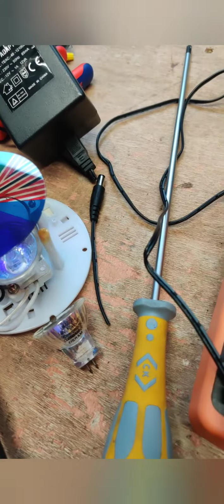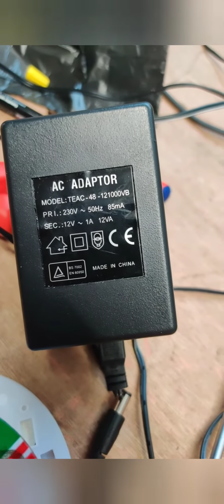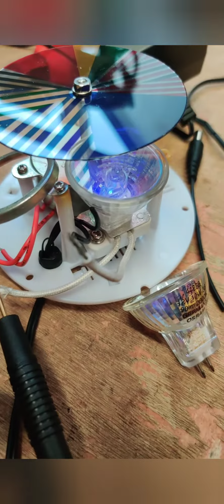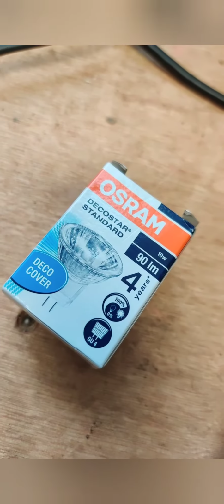Yep. Now, why did the last power supply die? Well, we see there that it's rated at 12 volt AC at 1 amp. I did notice that the bulb that was in there was a 20 watt, and from memory, a 20 watt was a bit strong. I did check the instructions, didn't give any recommendations, but I went down to my favourite bulb shop in the entire world, Steele's in 61A Hay Street, and I picked up a new bulb,